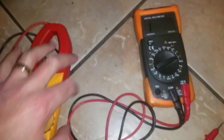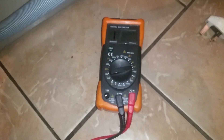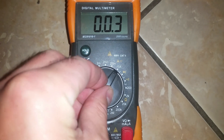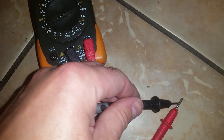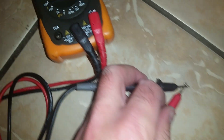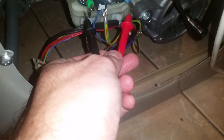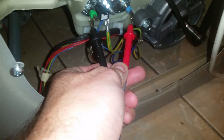As most of you will probably be having a DIY go at this, I'll use the cheaper one. We turn it to the continuity setting, and if we touch the two probes together you get a bleep. That tells you we've got continuity. We stick one probe on the neutral and one on the live, and we get a bleep which tells you we've got continuity — so there's no break in the circuit.